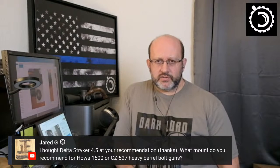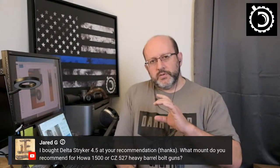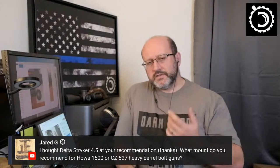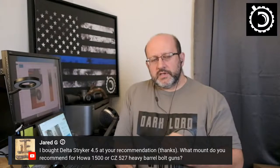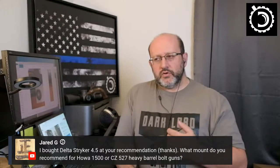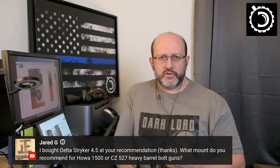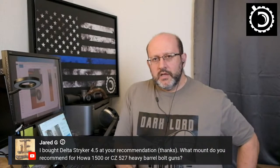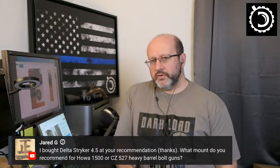The additional advantage of using these polymer or plastic inserts is that as you tighten the scope rings, you have aluminum rings and you have aluminum scope tube. And between them, there is some sort of fairly hard plastic that's still softer than aluminum. Under normal torque settings, I've never had any scope slip or get marked using Burris signature rings with those signature inserts.